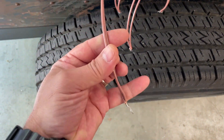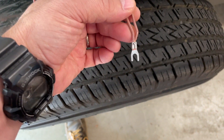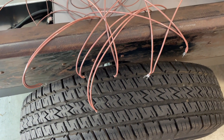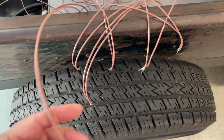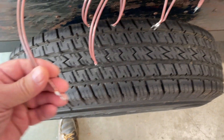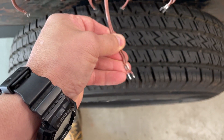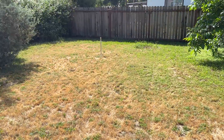These are some of my ground radials. I'm doing two into one — two radials sharing one hole. I'll run them out there. I've got 32 total radials, so there are 16 holes with two on each. I have to do a couple of round ones, but the rest are all straight.